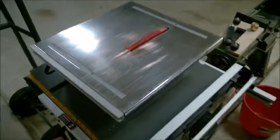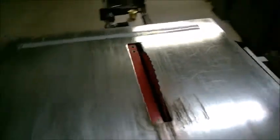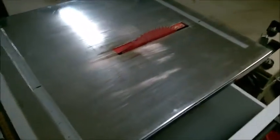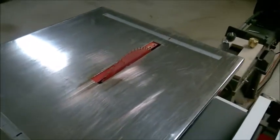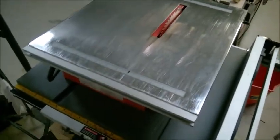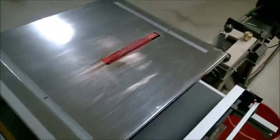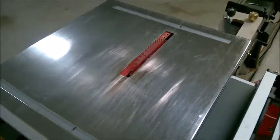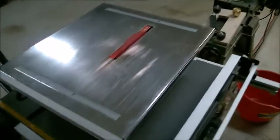It seems to have plenty of power. I've cut wood up to an inch thick — maple, an inch thick — and it works fine. This blade I've got is a pretty thin kerf blade, a Diablo 60-tooth from Home Depot. Thin kerf gives extremely smooth cuts. I've actually cut aluminum an eighth of an inch thick with it, and it does it effortlessly without much noise and no kickback.